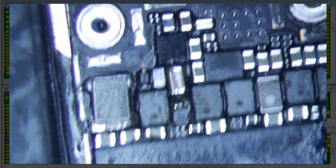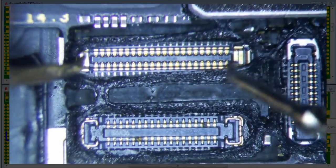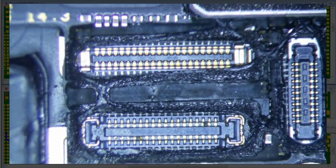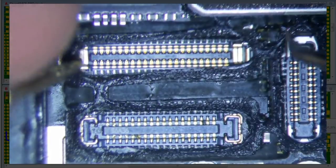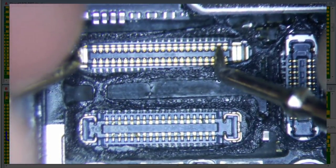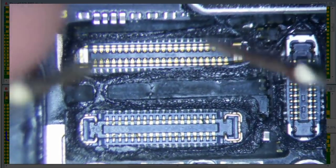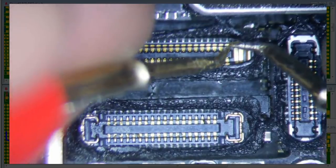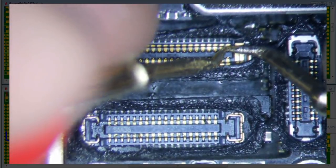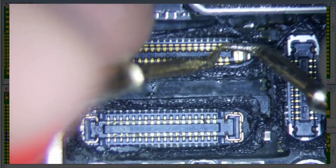Okay, so before we do anything, let's just double check everything, make sure all is good. So diode mode, and we can just go to the connector here and see what it is. So cathode pin 0.577, 0.479, 0.57. Okay, so that's not bad. I mean, if you wait a little bit, it should stabilize. It should be about 0.61, 0.54.